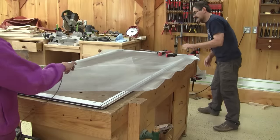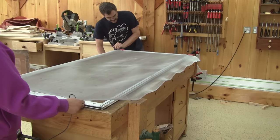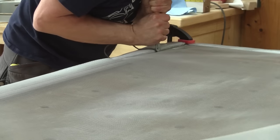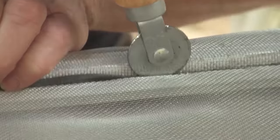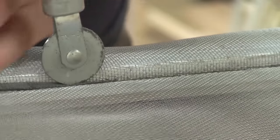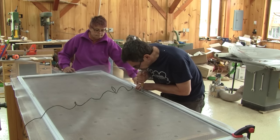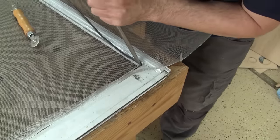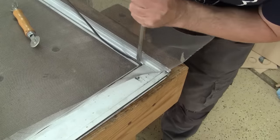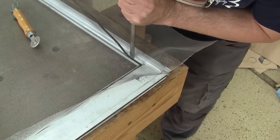When I'm done with the top, I clamp the frame so it won't move while my helper keeps the screen stretched over the frame, so I can shape another side. Then the rubber. Personally, I find that the corners are the toughest part of the job. The roller can't roll there, so I have to use a big screwdriver to do the job. But one false move and you end up with a hole in your brand new screen.